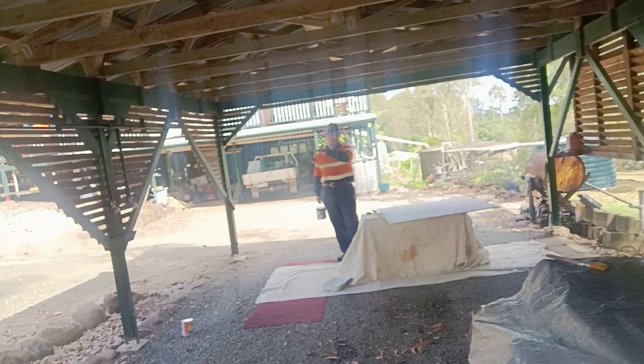When you cut the end of melamine, it exposes it to the weather. This is an outdoor area — it's for fly screen, so it's going to be exposed to rain and the elements. When you cut the melamine, you cut the protective sheeting off the edge, and when water gets in, it just dissolves the glue and the whole piece falls apart.